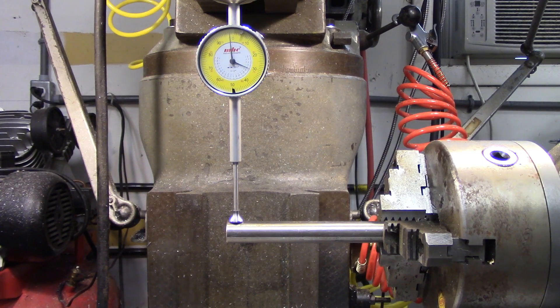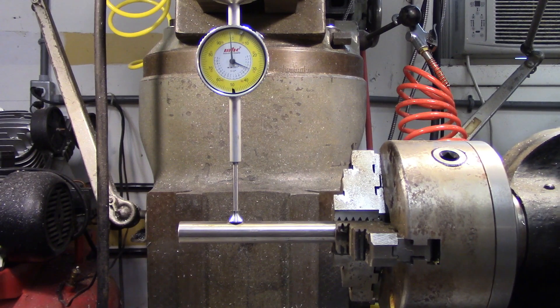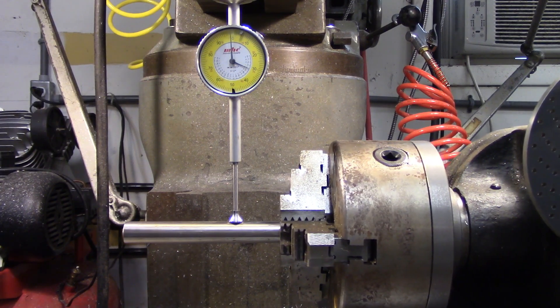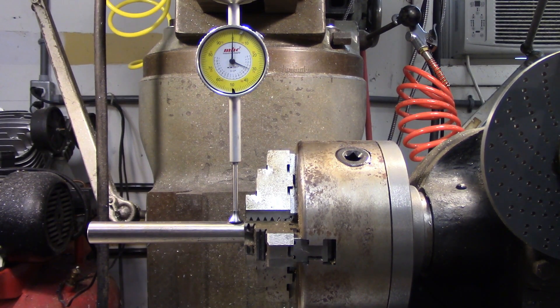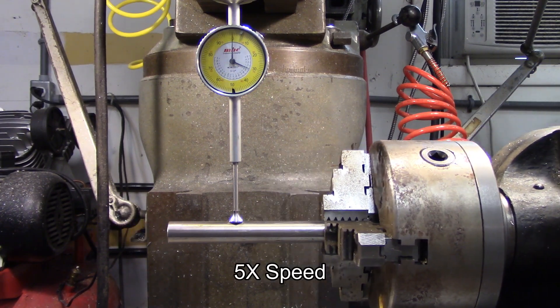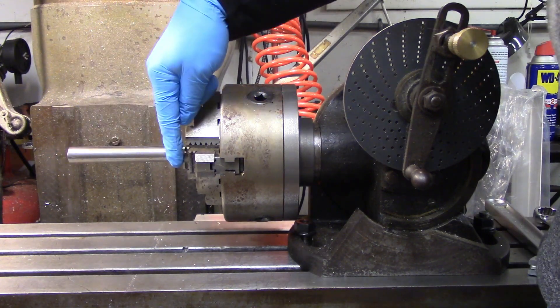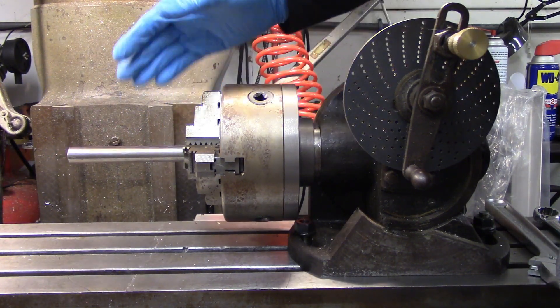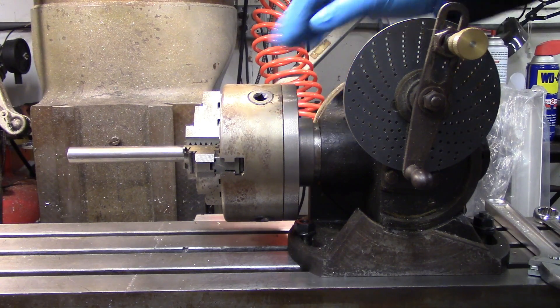We moved by a couple of thou, but let's see if this end moved as well. If it's still nice and straight across the entire length I'm going to be happy with that. It looks like we're still within a thou. We're less than a thousandth out, and for what this is going to be I think that's going to be totally fine — certainly way better than an entire millimeter. Now that I've got the top swept in, ideally I would do the side as well, but I've got that key on the bottom and I'm not going to be able to really adjust it if it's very snugly in the T-slot, so I'm going to go ahead and leave it.